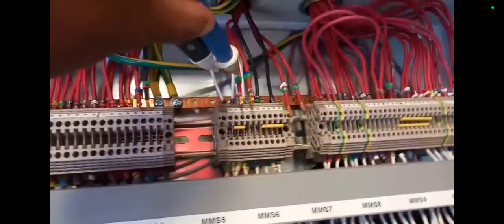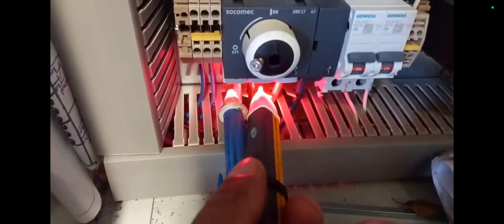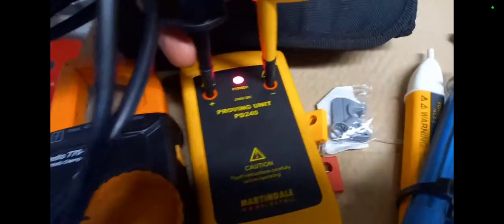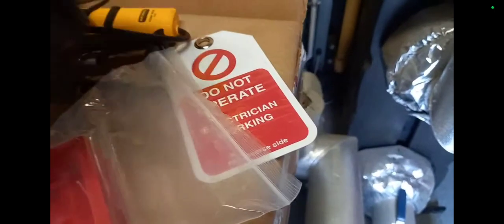Check for a known source first. Look at these loose wires — if you see any wires like that, try to deal with them or report it. Both volt sticks are lighting up, so this is an approved voltage indicator. This is me testing my approved voltage indicator on a proven unit — it's working. This is me checking that my multimeter is working — you can see 247 volts.